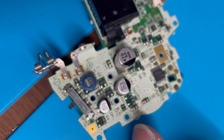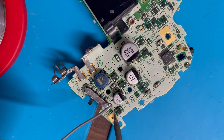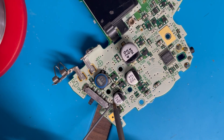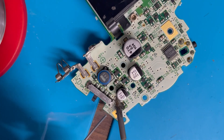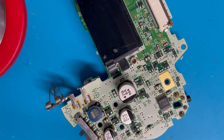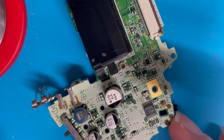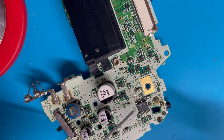Remove the board and what we want to do now is pre-tin all the points we're going to solder to. Pre-tinning most of the pads is really easy — just set your iron to about 350 degrees Celsius, feed in some solder onto the bottom part of the capacitor, and you're looking for a slight ball of solder so it turns shiny. Try to put your iron on the component first and then feed your solder in, rather than putting solder straight to your iron, because the flux burns off fast and then it's harder to work with.